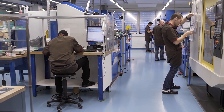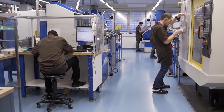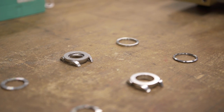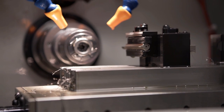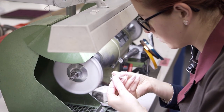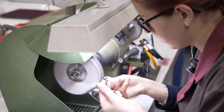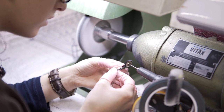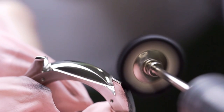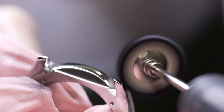We have to realize the various elements and components of the watch. If we start with the process of manufacturing the case, normally a case is made of three different components: the bezel, the body, and the case back. Another important activity is the polishing, which is an important process that has to be carried out by skilled people trained for a long time, to make sure they are not destroying what the machine has realized. They will spend between minutes and hours to polish one case.